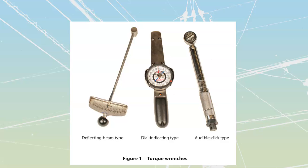But there's danger to that because if we over-tighten and we go through a couple of thermal cycles, summertime heat, wintertime cool, and then high loading points, you can create a lot of extra stress on that actual connection itself, which is eventually going to lead to it cracking or splitting, or potentially becoming looser. These over here are going to be torque wrenches. If you don't use one of these, you're not doing up that connection properly.